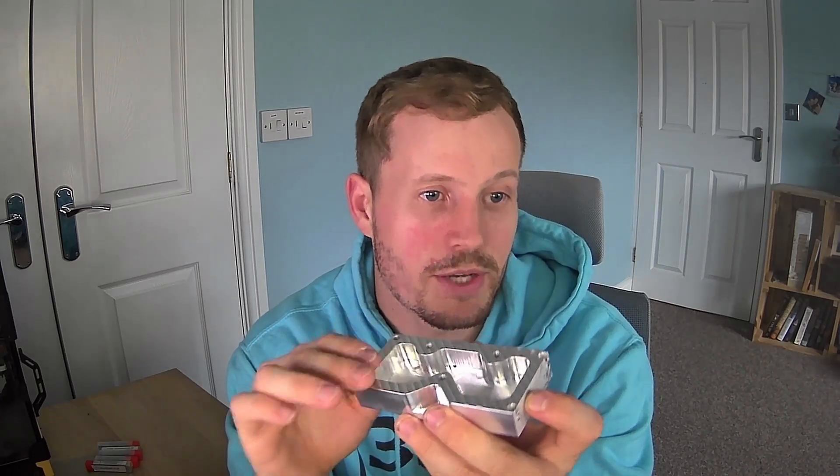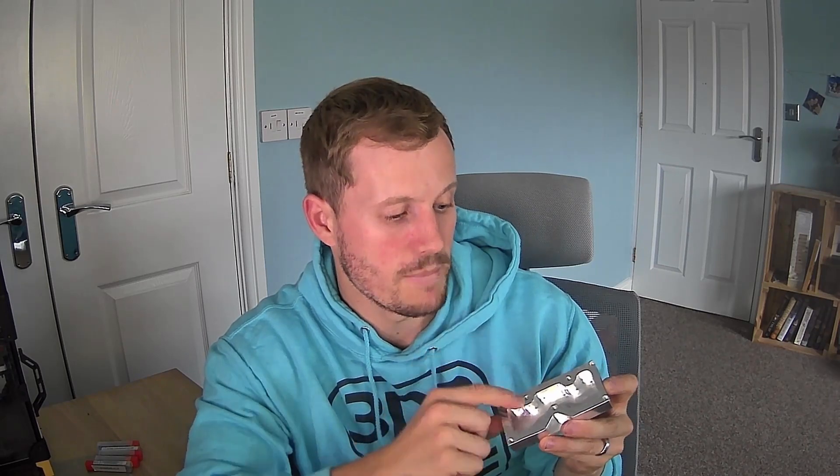So we're right back to this end, and that has just ruined that top surface finish. That said, overall I'm very happy with the performance. The part is dimensionally very good, within about 0.1mm accuracy. I was unable to tap the holes on the CNC machine and opted to just hand tap those afterwards. One of the other differences you'll notice: I milled those holes out as opposed to drilling. The machine just isn't really stiff enough to do drilling at 5mm diameter. The adaptive toolpathing for clearing out this pocket has left a really nice finish and was really quick. The total machining time for this was about 30 minutes, including removing all the stock off the back.